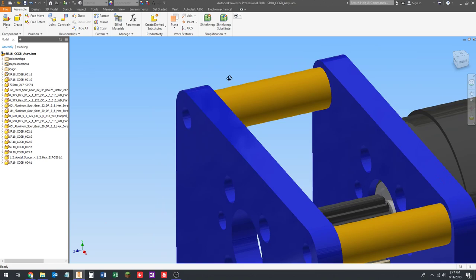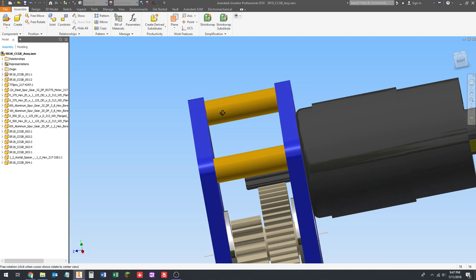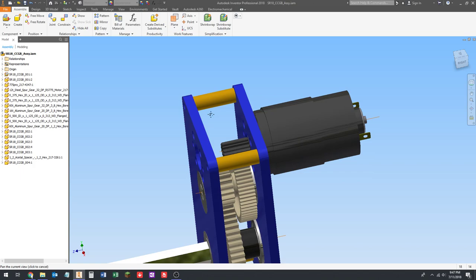But with a quarter inch, you definitely get three full threads for sure. And then obviously a quarter inch here. So that's a half inch overall. That's what we should shoot for. So I think we want a half inch fastener here.